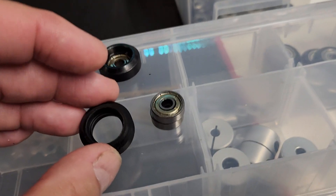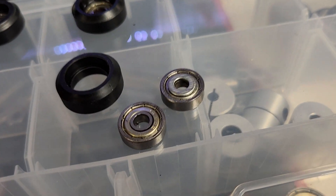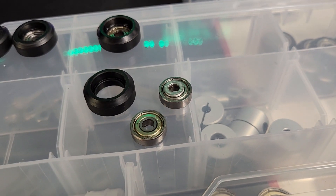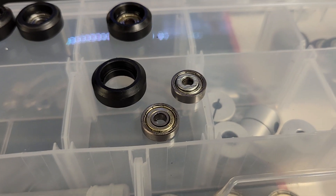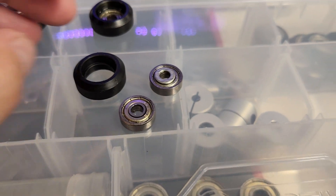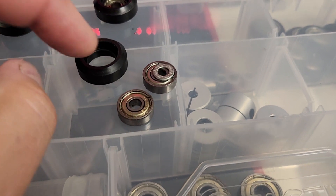This wheel has a bearing problem — either it's been over-tightened so badly that it's squashed that little lip in, or the spacer was too thick right from the get-go. I'm seeing this on brand new machines, so they're either over-tightening these at the factory, or the spacers are too thick to start with and you never had a chance.